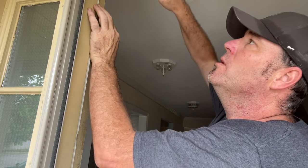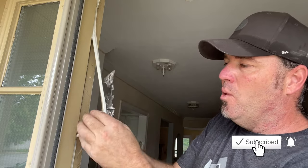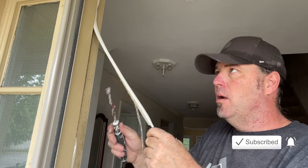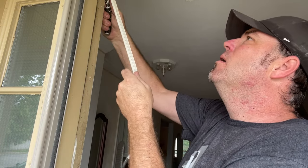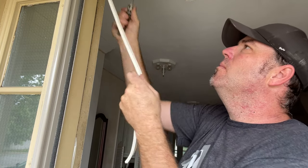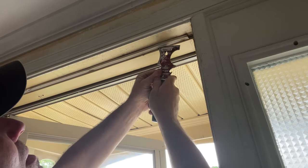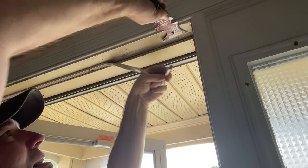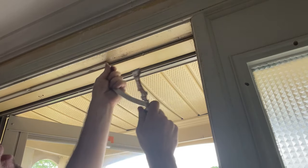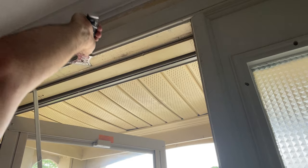So this is a super common mistake with front doors. These newer front doors have a slot for the weather stripping. Somebody's put on some weather stripping here that doesn't go with this door. This one doesn't even seal the door — it gives the illusion of correct but it's not correct. This one's even been stapled on. Make sure you get all the staples pulled out if you have them.